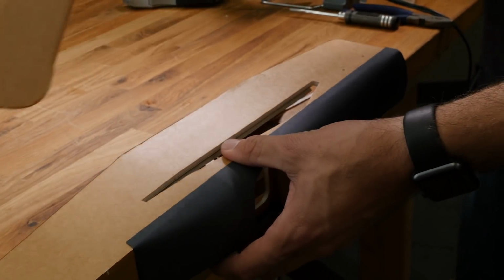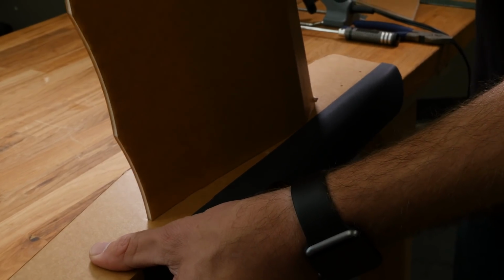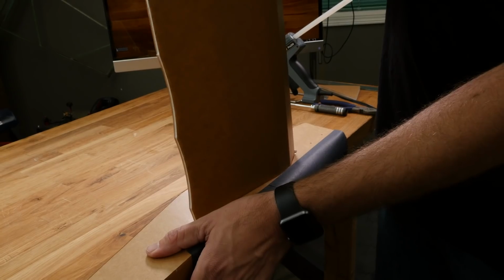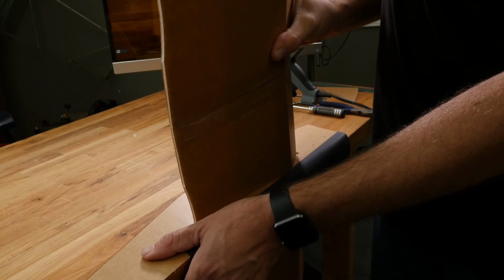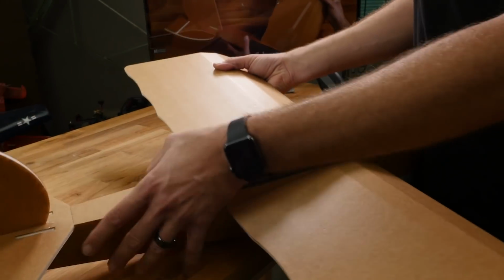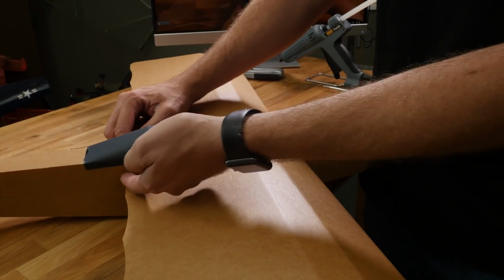Now with the plane faced on the edge of the table here, where the table is supporting this main back portion, we're going to go ahead and start the wing in a rocking motion at an angle. You notice I'm just rocking it back and forth very carefully. And a little bit too far so we can rock it back a little bit. And then I'm also going to pull the wing up towards me forward, just so it seats nice and tight against the cavity.